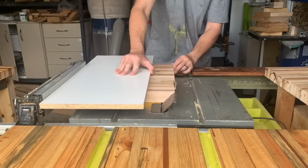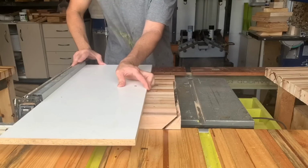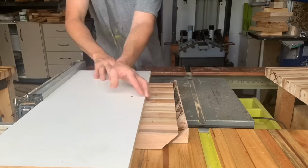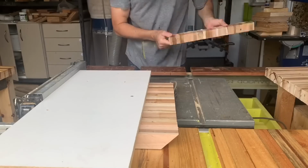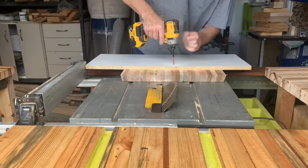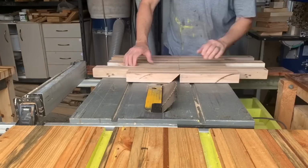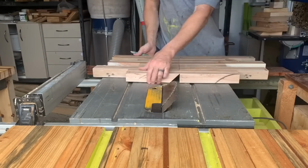Now this all looks pretty cool, all going to plan, cutting the miter, but this is the one job that has given me a load of grief. But basically this is the technique. Cut your first 45, whip the board off, chuck it on the other side, cut your second 45 and you have a nice miter with a nice waterfall.